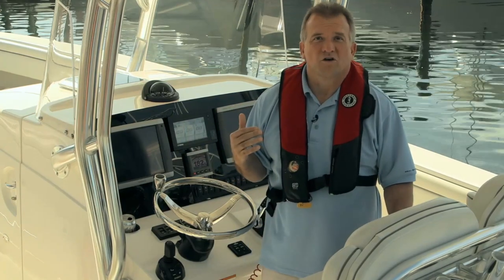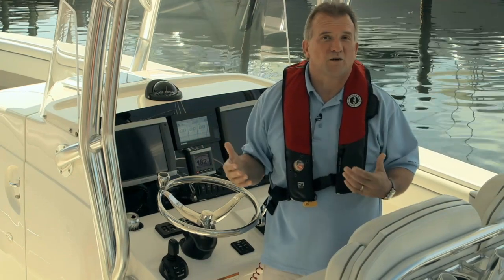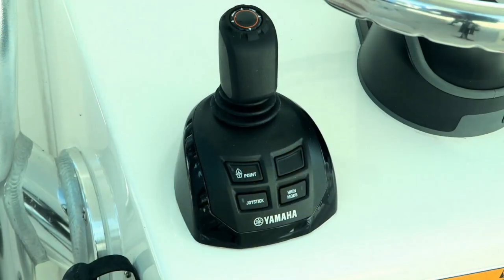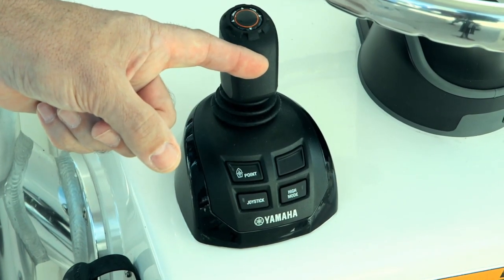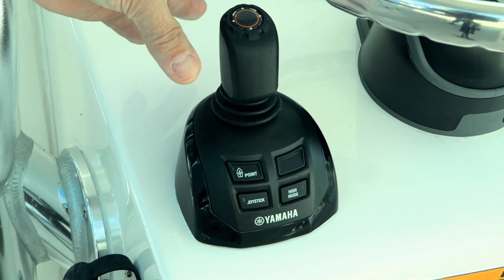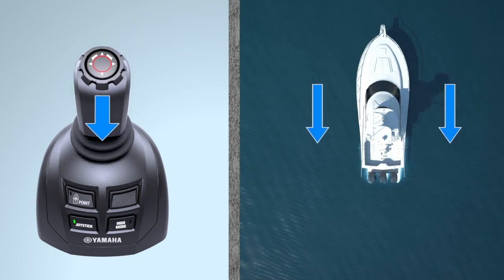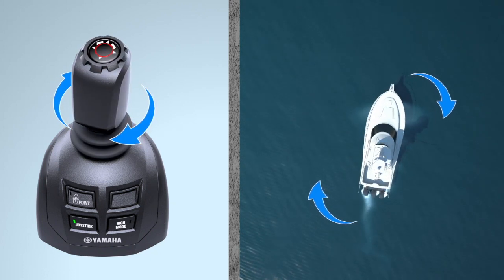Forward and backward, rotating in position, moving side to side — ever seen a boat parallel park or move diagonally? Envision the front of the joystick as the bow of the boat and the back as the stern. The sides of the joystick represent the respective sides of the boat, and the center detent position is neutral. To move the boat in any direction, simply move the joystick in a similar fashion. The more distance you move the joystick, the more throttle response you'll get. Rather than bumping the shift and throttle levers, simply continue to command the boat with the joystick in the direction and amount of throttle needed until you reach your desired point.